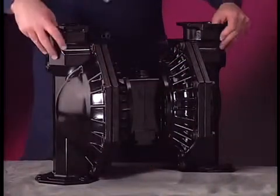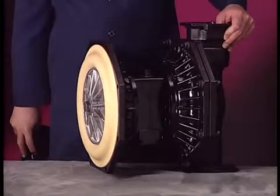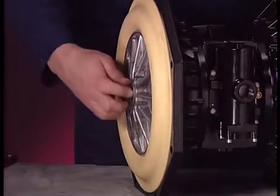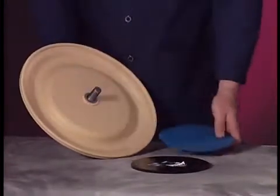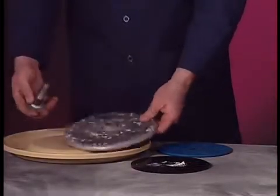Use the 16-millimeter socket to remove both fluid caps. This will expose the diaphragms. Using the one and an eighth-inch socket, loosen the cap screws and remove a diaphragm assembly. You can now remove the backup washer, the cushion, the diaphragm, and the fluid side washer.